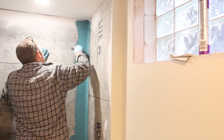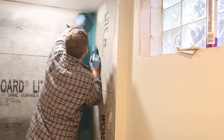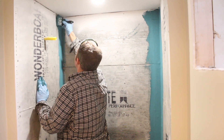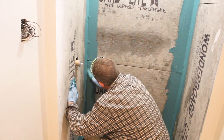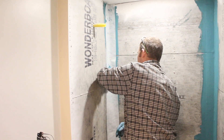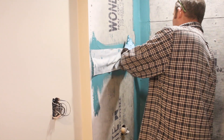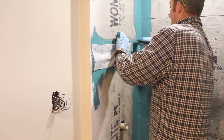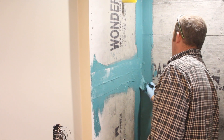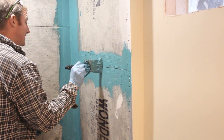Taking your time and really paying attention to how much liquid waterproofing you're adding is super important. This is just the first coat — we did a second coat over top of all of this. The most important thing is to completely embed the fleece on all the seams. For a horizontal seam between two adjacent cement boards, fill it in with liquid waterproofing, add the fleece over top, and smooth out the fleece. You'll have a little bump in the center where the two boards meet, but that's not a big deal — just try to smooth that out as much as possible.